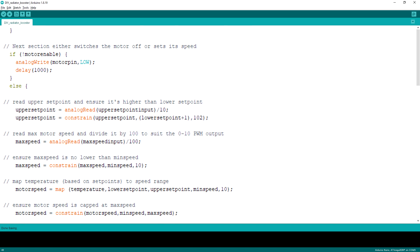Is the motor disabled? If so, set the speed to zero and wait a second. If it's enabled, go through the final bit of code which sets the motor speed. First, it's time to read the upper setpoint — we've already got the temperature at which the fans come on at their minimum allowed speed; this one sets the temperature at which the fans are running at their maximum allowed speed. Again, this is divided by 10, but this time instead of being limited between 1 and 100, it's limited between 1 plus the lower setpoint and 102. This ensures that no matter what settings you've turned the presets to, the upper setpoint is always going to be higher than the lower one. Next, we read the last of the presets, which acts as a speed limiter — we'll just read it and divide by 100 to get a range of 0 to 10. We also make sure that the maximum speed isn't lower than the minimum speed. A really useful map command takes the temperature relative to the lower and upper setpoints and outputs a corresponding motor speed relative to the minimum and top speeds. That speed gets limited by the maximum speed read earlier and the result is finally ready for driving the motor output pin using pulse width modulation.